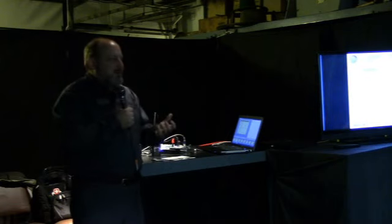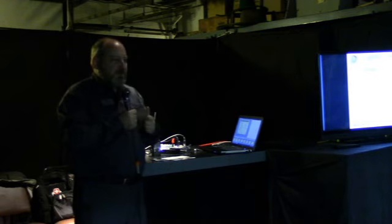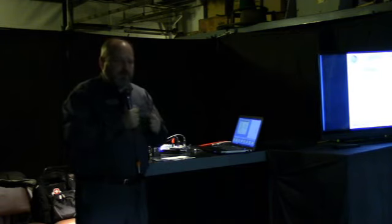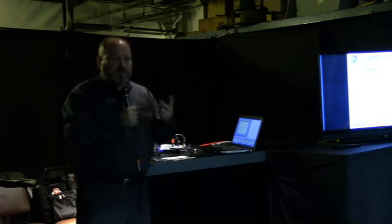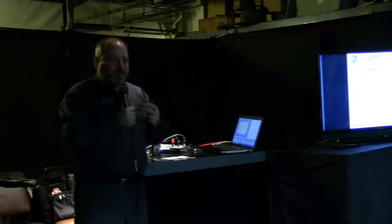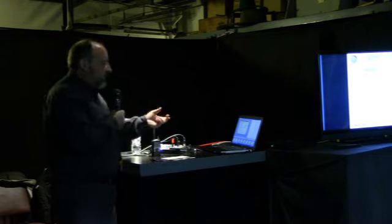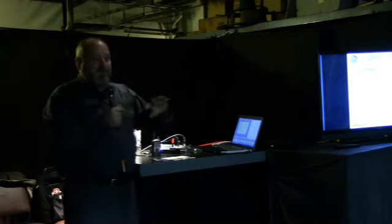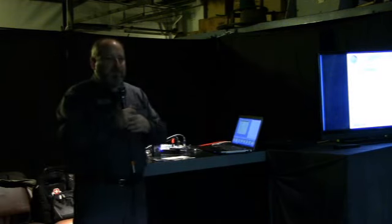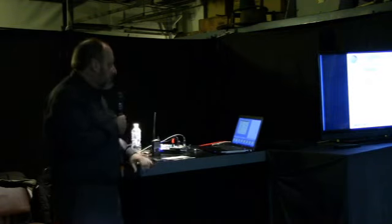Whereas with an FM repeater, you have to set it up. You have to put in the frequency, and then you have to get the tone, right? So you have to get the tone, then you have to turn on the tone, because of course setting the tone is completely separate from turning on the tone, right? Which is one of the two steps people generally screw up. Like, oh, I got the right tone. Yeah, but it's not on, right? And with this, you don't actually have to even do that. Now, if you want to do some of the other routing features, it can get more complicated, right? But the basic repeater operation or simplex operation is very, very simple.